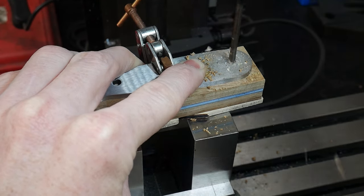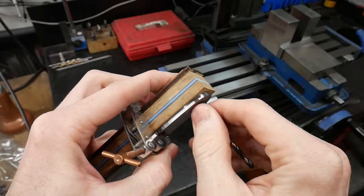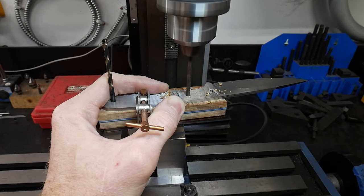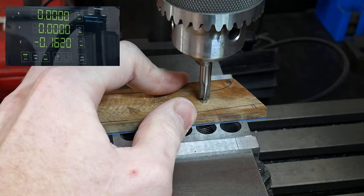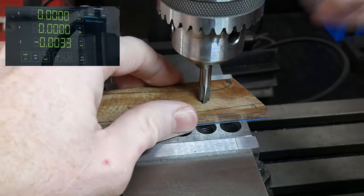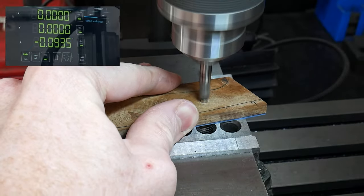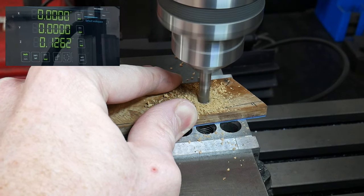I drilled number 23 holes through my tang and used an extra drill bit as an alignment pin when drilling the second hole. Using a counterbore with a 5/32 alignment guide, I bored a 1/4 inch hole about 130 thousandths into the scale. After my handle shaping, I'll come back and adjust the pockets carefully to fine-tune the depth of my fasteners.